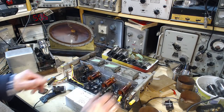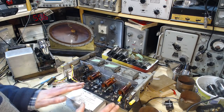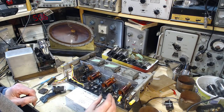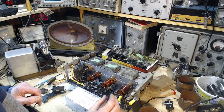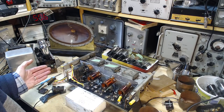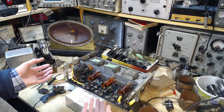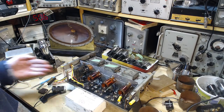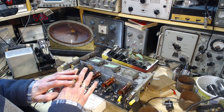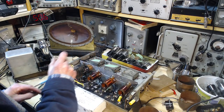There's no IF frequency in this radio. But as the radio builds up the strength of the signal, in the case of a superhet, in the IF, especially in the last IF coil, there's a lot of power in there. There's a lot of signal strength in the last IF coil. So it's producing an interference signal, if you like, at 455. But the radio is actually tuned to something in the AM band, like, I don't know, 980. So the 455 can't get back into the front end and come racing through. Remember, the front end is very sensitive, so it's going to pick up stuff. Well, in a superhet set, the last coil cannot energize the very front end of the radio.